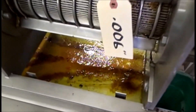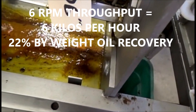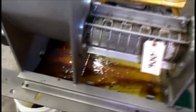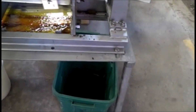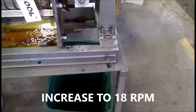We're going on 20 minutes into our first run. Now the cake is barely coming out. The oil flow is atrociously little. We're going to see what we've got in 20 minutes, and then we're going to increase the speed. The cake is coming out wet, as you saw. So we might as well go faster since going slow has not made dry press cake.